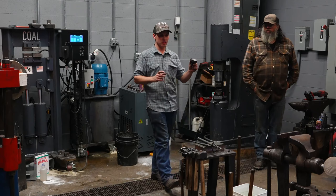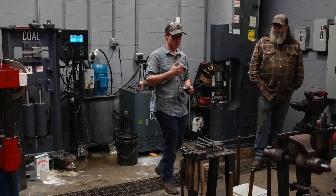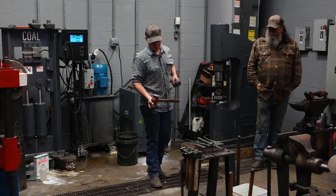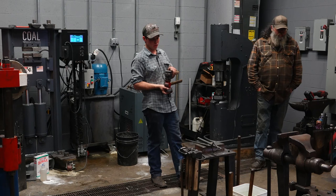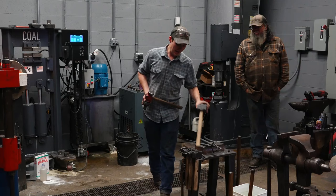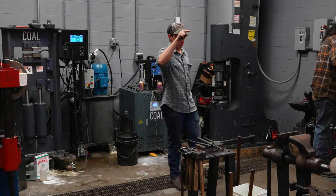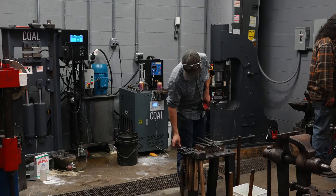That action does several things at the same time. One face of the hammer will be in the cupping tool. That'll be forging the round die of the hammer. One side of a rounding hammer is round. The other end of the hammer will be impacted by a flatter. Then the striker will strike the flatter. So we are creating the flat die, the round die, and our drift in the center is going to contact end to end. So we're gonna be forging the hole all the way around the drift. That's very important. I'll show you why when we do this. That's a brief description of what's gonna happen here.